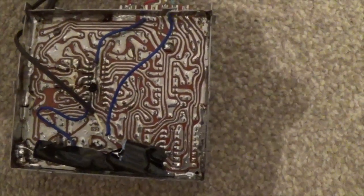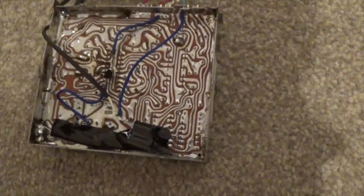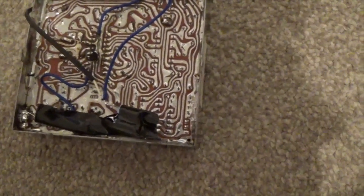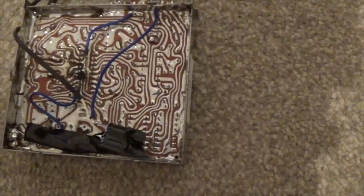I did read about this before, a long time ago, and I couldn't really find any information other than the use of the transistor, so I looked at the pin outs. I did find a French or Italian website that had some information about using caps and a couple of resistors — a 68 ohm and a 1K.